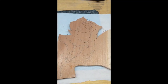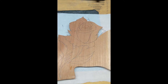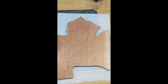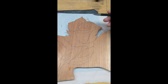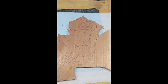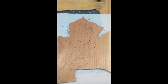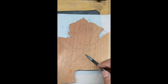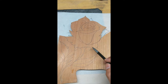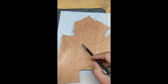Here's where I have to stop and make a confession. I thought about whipping this up really quick as a project, and it occurred to me that I'm taking some shortcuts I should make you aware of. I cut this entirely out of one piece of wood, and that has disadvantages. First and foremost, the disadvantage is in color variation — because it all comes from one block of wood, it all ends up being the same color unless you use stains. To show you a more traditional form, I'm actually going to cut this one out of a piece of dark cedar so you can see a contrast.